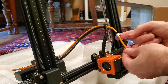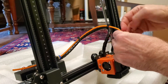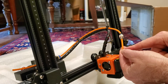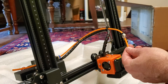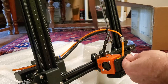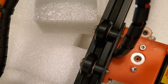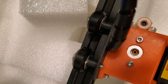Then you're going to need to take off this nut. You can depress the little press washer there to actually move it once you get it out. You're going to have to remove 36 millimeters of tubing from the Bowden tube, or else you'll have an incorrect length of Bowden tubing for this overall setup. You're basically replacing that section with what you've cut. Push your tubing all the way down until it makes contact with the nozzle and gets nice and flush inside there.